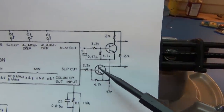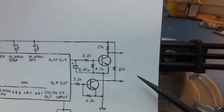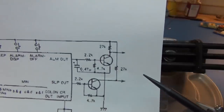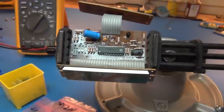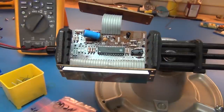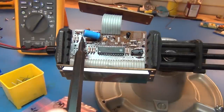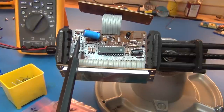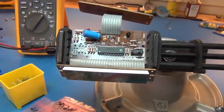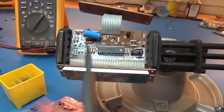And I also looked at the trace. It's just going to be driving the alarm, essentially the alarm speaker, and making it go. So, the alarm isn't even on, and that thing's getting hot. So I'm going to leave it out when I put everything back together, so there won't be an alarm. But again, if it's somehow damaged or draining, or something else is able to pull it down like that, at least it'll validate that the display is working and bright, and then I can find a replacement transistor and see if it fixes it, or start looking for what else might be.